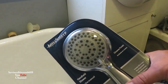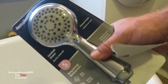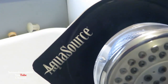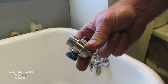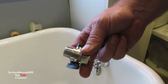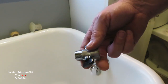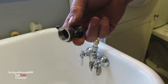Here's what we've got — we need to see if we can get it to mount right on top so we can have a shower handle. This is a hand shower with a few different settings. What I did is I picked up a little shut-off. If you don't have a shut-off on your shower, you should always have one — you waste so much water when soaping up. You let the water down, turn it off, soap up, turn it back on, and rinse off. Seems like you save a lot of water. I bought that extra so I can mount it on the handle where you can reach it.